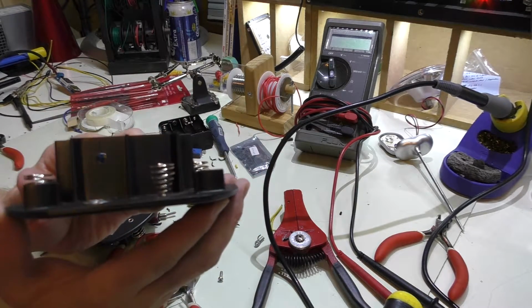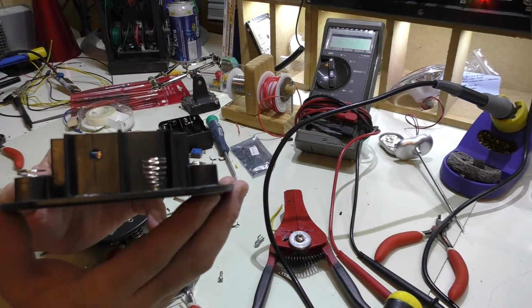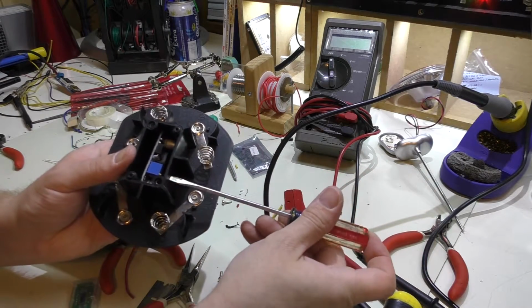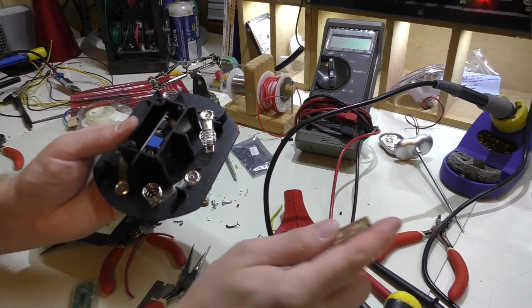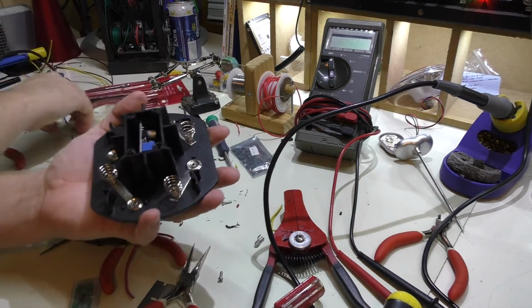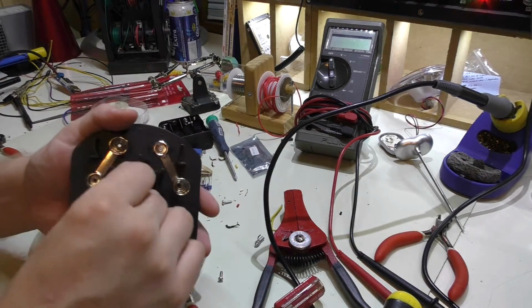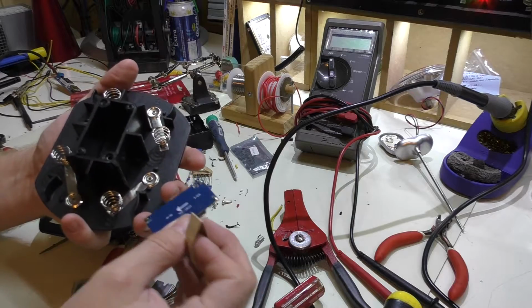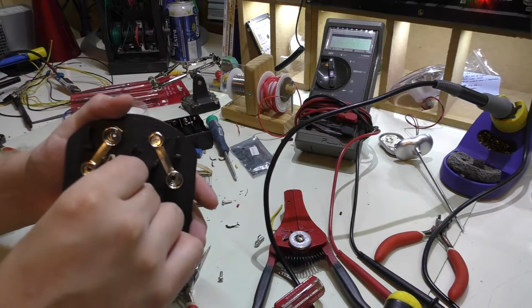But that drops in, and you probably could barely make out the little copper screw on the other side there, but it works out perfectly. If I hold the screwdriver into that hole there, you can see I can reach it just right. So that's pretty good. And once I get the wire soldered back in, that'll hold it in the spot, because that's basically what was going on. The little wires that were protruding were just acting as a slide and friction and holding it in.